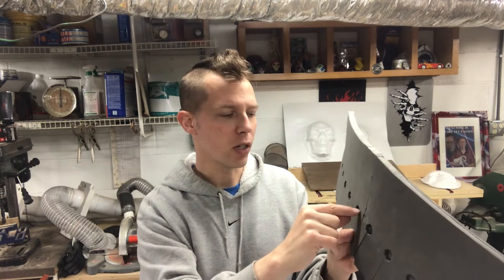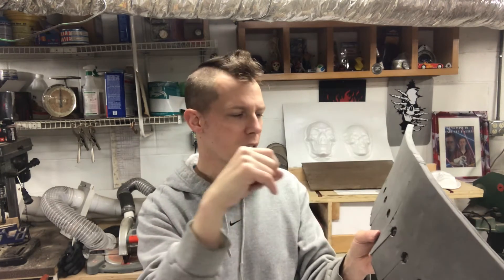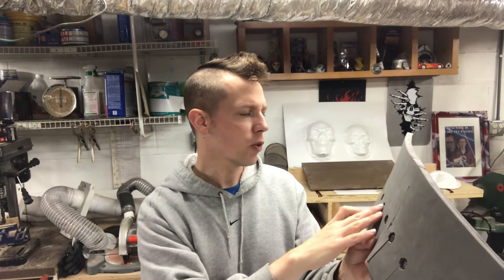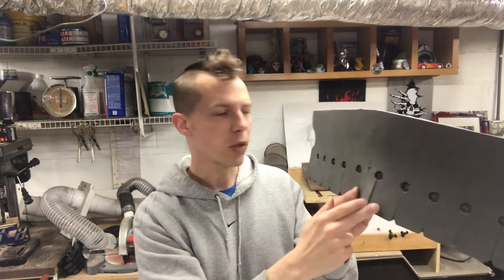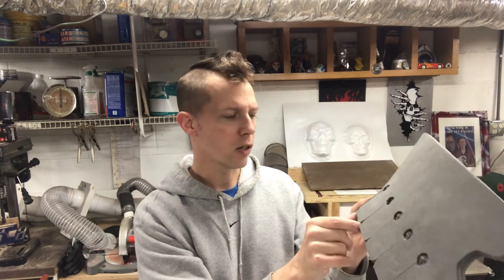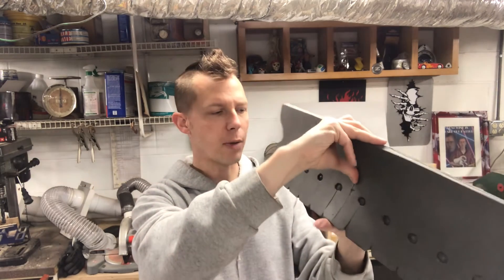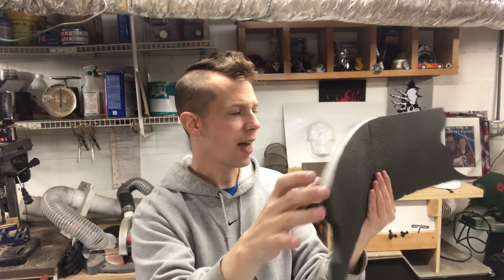If you don't go slow, you get some tear-out, which is what I got. It's almost like a raindrop shape where the middle is raised — like you just pulled the center out. I think the wood-burning tool will take care of that. I also sliced in between with a razor blade, and cut the corners out. I think I'm going to use a sanding block or Dremel and just round it over. I had a little bit of trouble getting it to seal tight. These little flaps are supposed to curve out like that, and if all else fails I'm going to put a little bit of acrylic caulk in there to smooth it out.